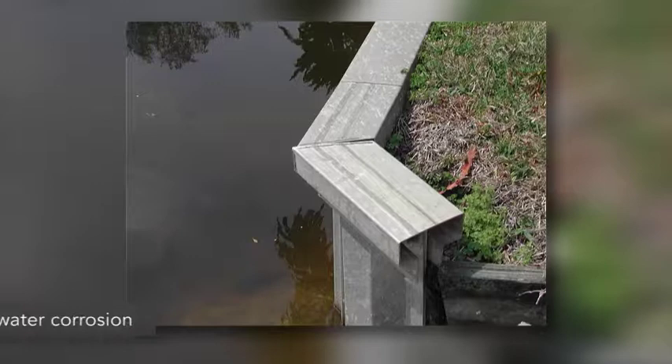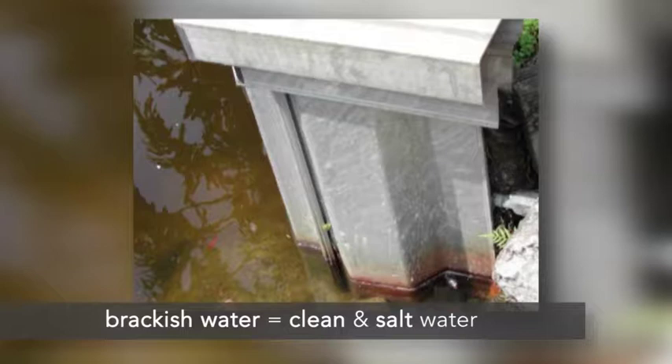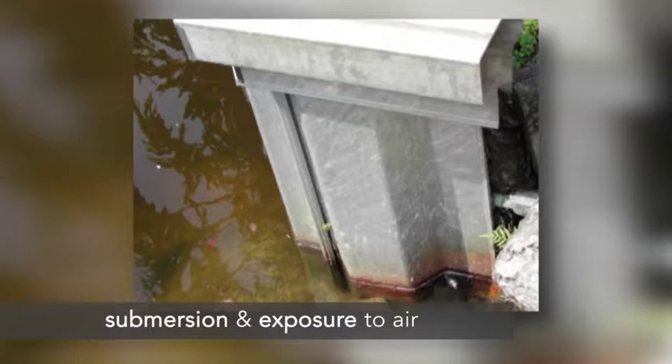Corrugated galvanized steel — the galvanization helps protect against water corrosion, and it's a way to create a seawall without having to use concrete. Unfortunately, when you look at the water line, this happens to be brackish water. Brackish water, by the way, is a combination of fresh and salt water mixed together — sort of a diluted salt water. They call it brackish because of the minerals in it. You can see right here at the water line where it's corroding, and that's partially due to the submersion and exposure to air — a combination of air and water, which is two bad combinations when dealing with steel.